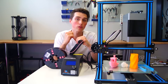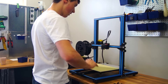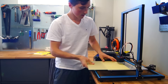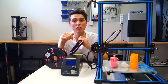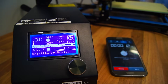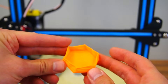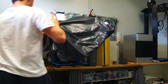Something I became very fond of very quickly is the included glass bed. You can take great advantage of printing with a shiny first layer, perfect for something like phone cases. However, most filaments tend to adhere better to tape, so that's what I normally use. ABS is one of the trickier filaments to print, and this is one of the very few problems I found with the printer. The heated bed takes a long time to heat up and was only able to reach 85 degrees Celsius, causing ABS to cool down too quickly, resulting in layer separations. The solution is simple — you need to enclose the printer and trap the heat inside.